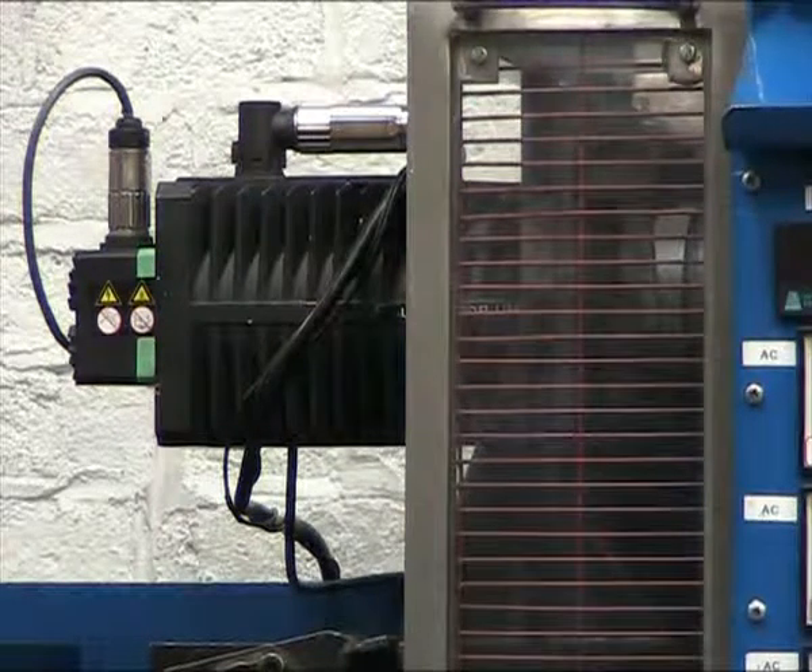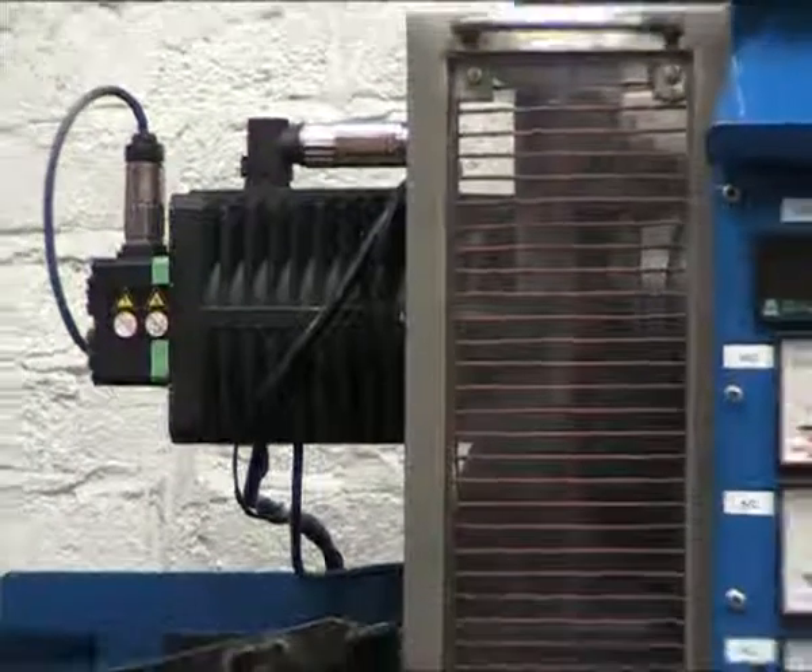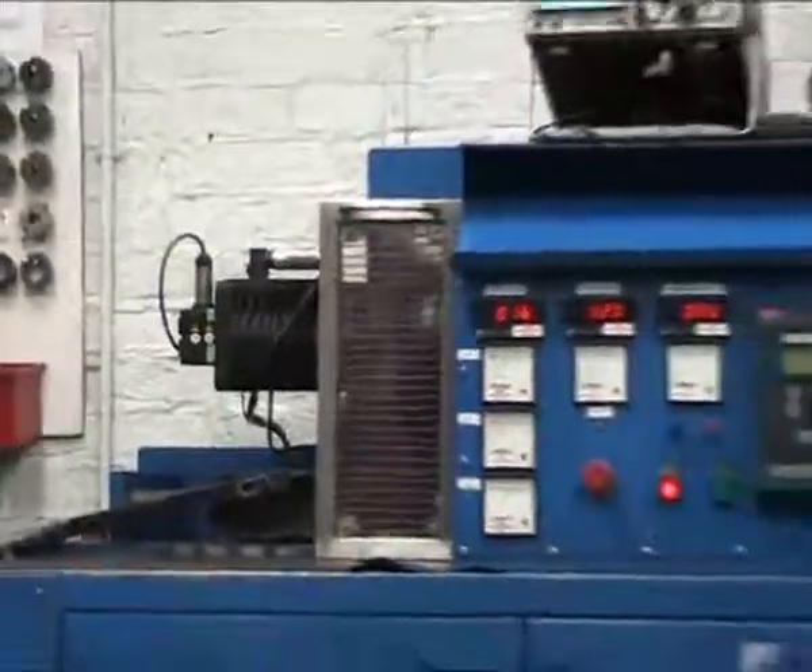Here is the CT motor being tested. The engineer runs the motor up to nameplate speed and fully loads the motor to nameplate torque using the touchscreen on our load test interface controller.